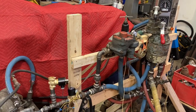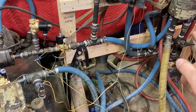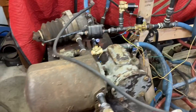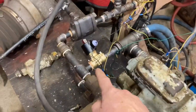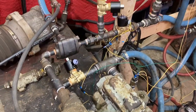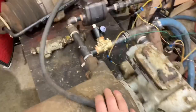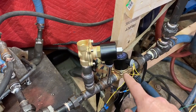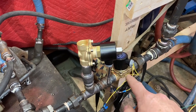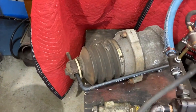What that does is prevent backflow from the main res through the brake valve and backwards through the distributing valve. It sounds complicated, and it is, but you add that and you add that and it stops it. So if you've stopped any air moving through the distributing valve, you wouldn't have any air going to the brake cylinder. So you have to grab air from another spot — I've taken it from the M3 feed valve, come down through here and across. I've added a normally closed valve, so when the system goes into emergency, this valve opens, allows the air through a double check valve with a shuttle inside — the shuttle pushes over, the air goes into the brake cylinder and everything's happy.